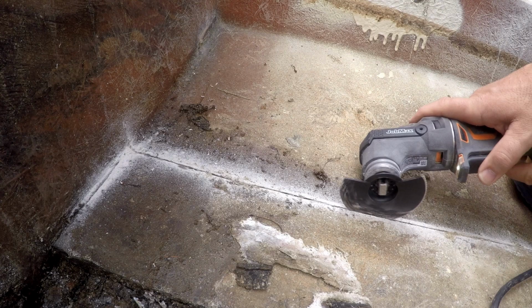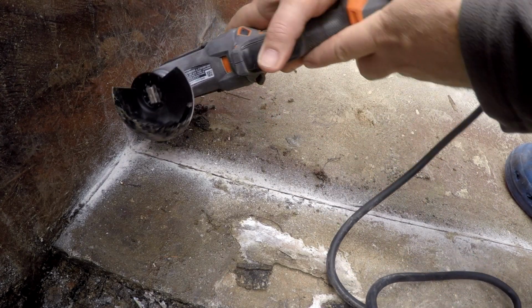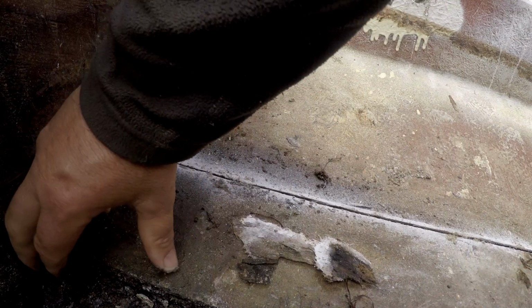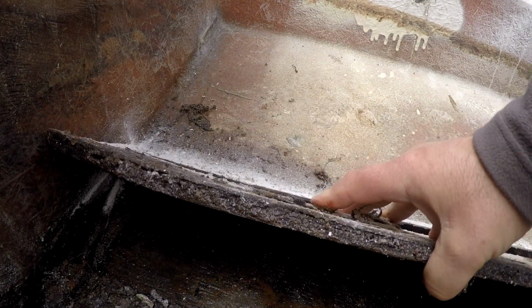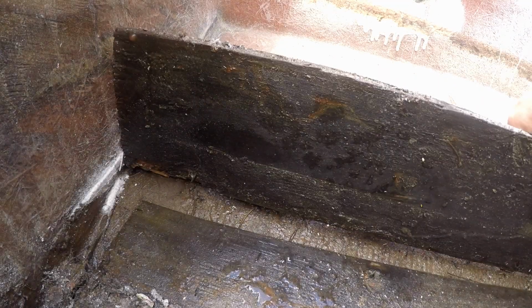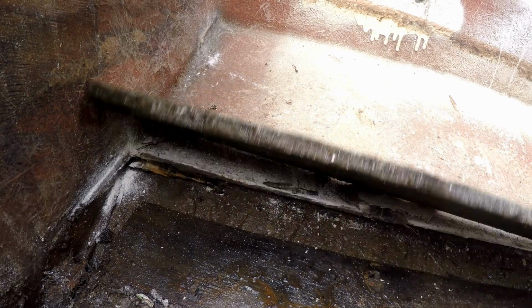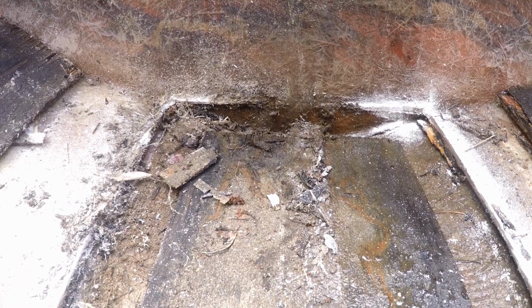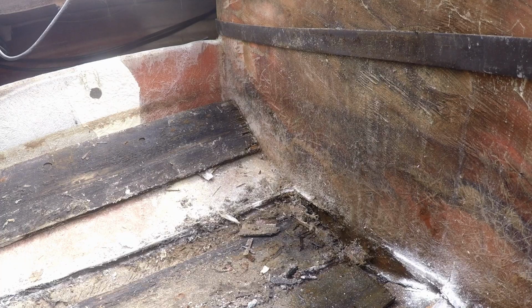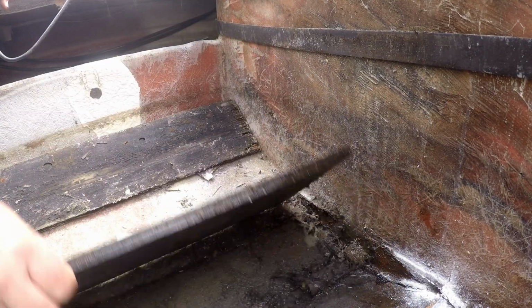The multi-tool makes short work of the thin layer of fiberglass installed at the factory, and I easily avoid cutting into the hull. The underside is untreated and saturated with water. This is the stark reality of owning a 30-year-old boat. The lower layer is not bonded to the hull, is untreated and saturated with water and fuel. This is clearly the major cause of the tank failure.